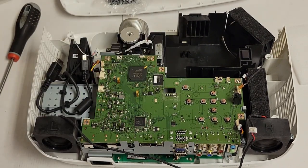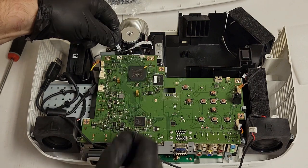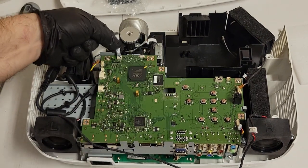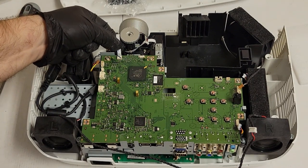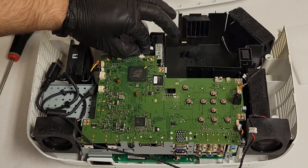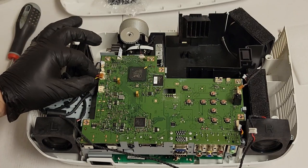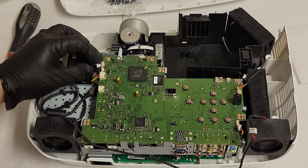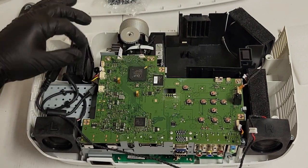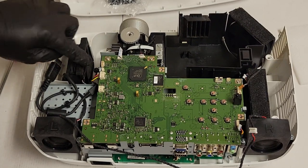There we are. All right, so it's gonna go out there, that's here. Let's plug the color wheel in. We'll dress that wire after everything works. Oh, that might actually do it. Color wheel sensor. Come on. There we are. Blower fan. I think they call this the DMD fan because it blows across the optics. Because it blows air across that heat sink and everything.